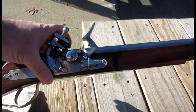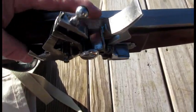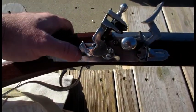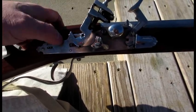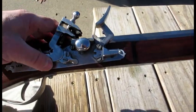That is a separate unit compared to the flash cover, which is right there. The reason for that is because you have a lateral sear, and that means that that little metal bar there will pop out when the cock is fully cocked. As such, there is no half cock. So as a safety feature, this has to be kept swung away until you are actually ready to fire.